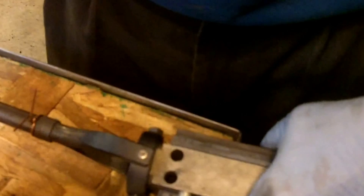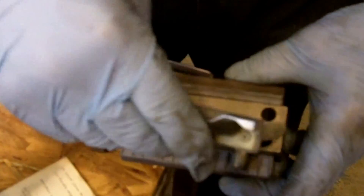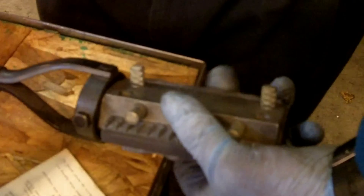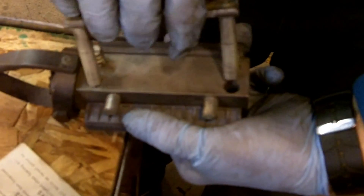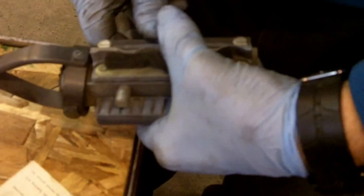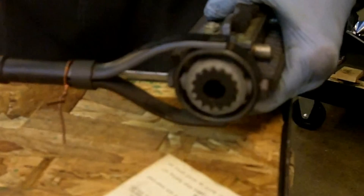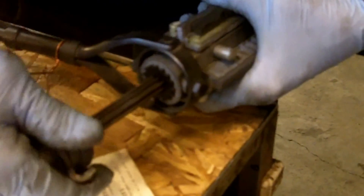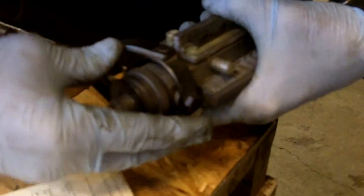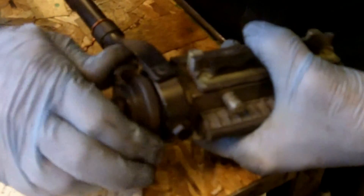You just hold them with your hand, then do the same thing with the guide. The guide goes in only one way, by the X. Rotate it 90 or 180 degrees, put the other one in at the X. Just gently hold them together, then take the rack. You rotate the hones on like a universal joint. Just push this in, hold them together lightly. Then this fits in here, and this is the fine adjustment of this wing nut.